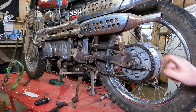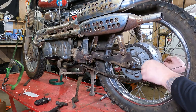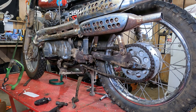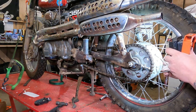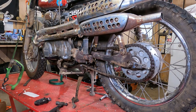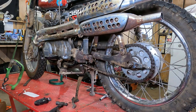We'll loosen up this jam nut on this side — loosen it way up — and loosen it way up on the other side. Now we're going to crank these screws in until they make contact and start with some slack in the chain. I'm going to take a flashlight and a ratchet and start cranking the right one in first. As I do that, I can look up the chain and see the alignment. You can see as I'm doing that, it's lifting up the chain right here — so it's setting our chain tension. I'll crank a little on the other side, all while looking up the chain.